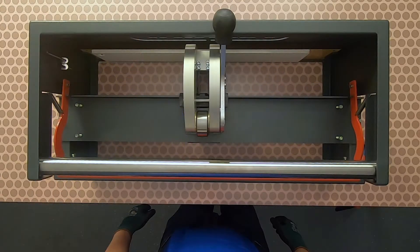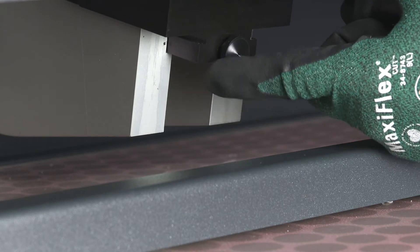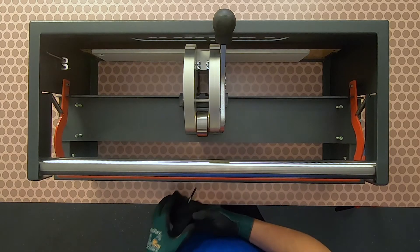Let's get started. Let's make sure that the punch is set up to punch the finger dimensions required for the job by reviewing the punch block and the punch board. For the punch block, first loosen the fixation screw on the C-frame wedge until you're able to slide it out.